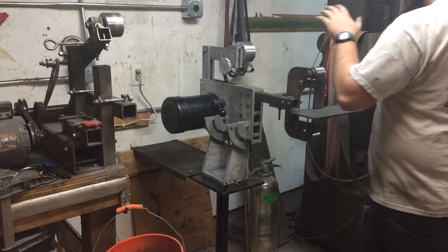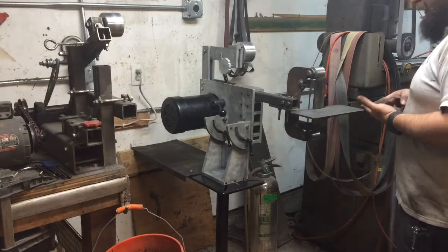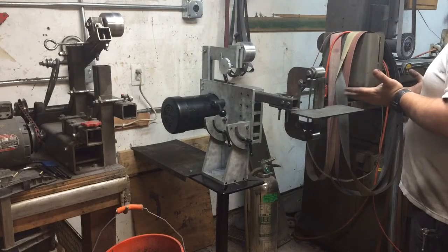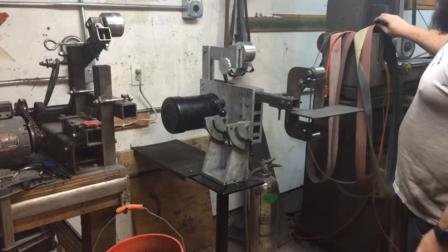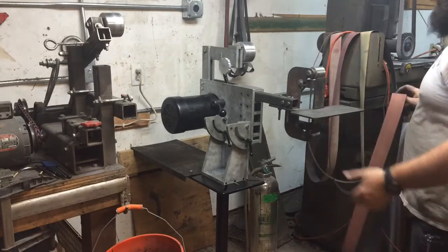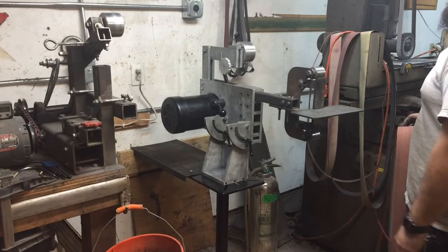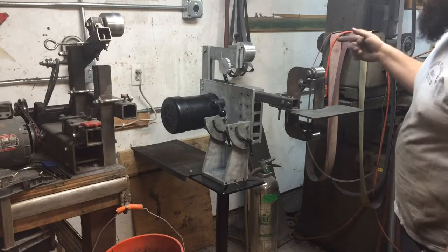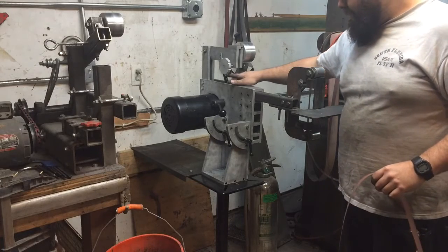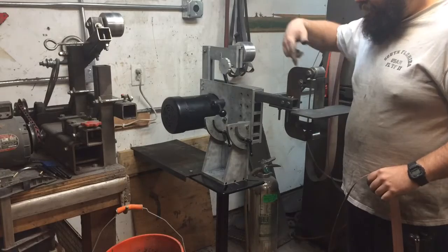Now, the other thing I went ahead and did, I got a 100-pound spring for this. Already tried 50, we tried 80. The 80 would probably work just fine, and I'll have that as probably a backup if this one ever fails on me. These things don't last forever. But just a quick note, if you want them to last longer, you want to put them with the cylinder end on top, the rod end pointing down.